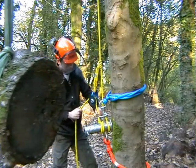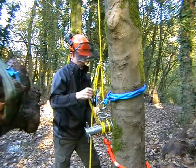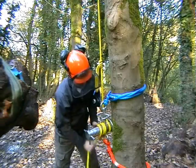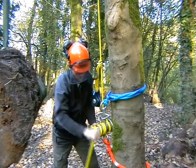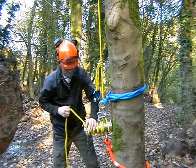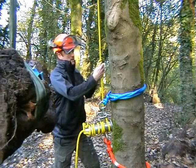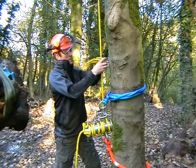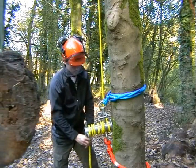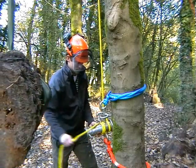Now when we have all the tension that we need, remove the rope from the pulley and put several wraps around the barrel, pull and tie it off. Then we can slip out the pulley, remove the friction cord, and away we go.